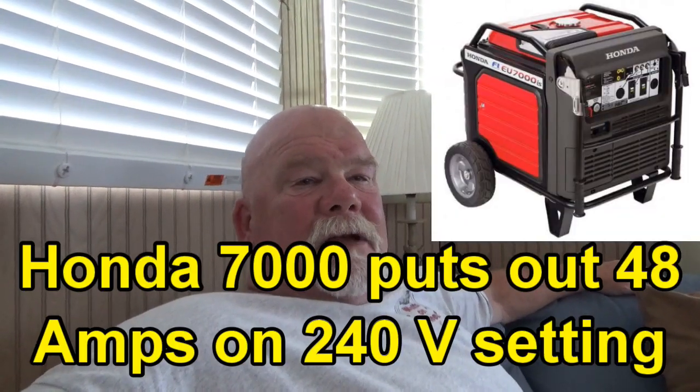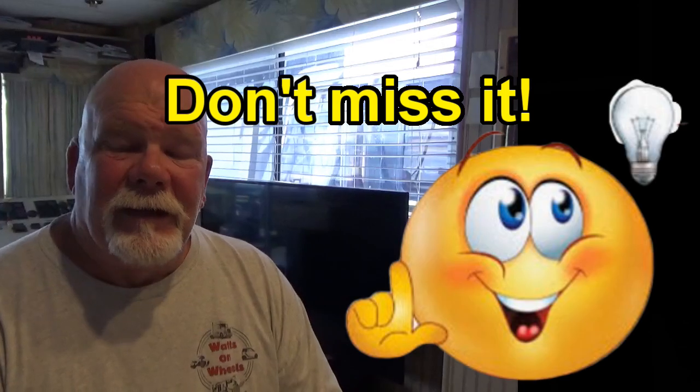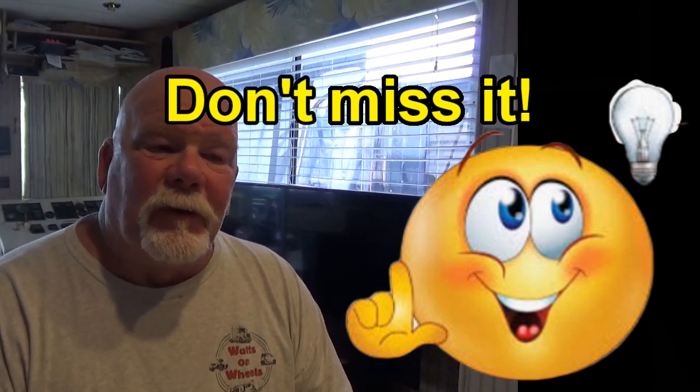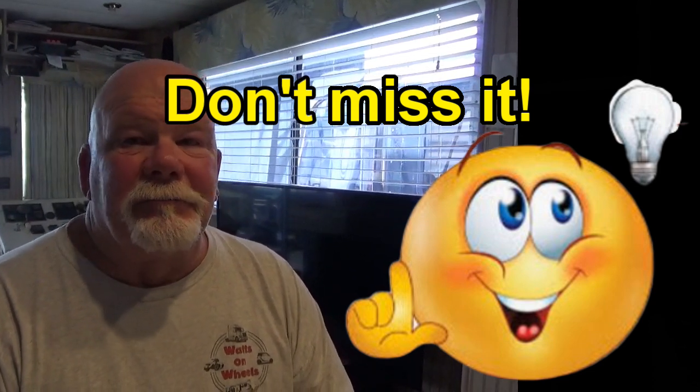In conclusion, the easy start is best when you have a smaller generator and only one AC unit in your RV, so you can still run off the generator with the AC unit and other small appliances running alongside. If you have a larger generator like we do — we have the Honda 7000 — you can run both ACs with easy starts and still have some power left over. Are you glad you put the easy starts in? Yeah, for the generator, because we do a lot of boondocking. In another video, I have a solution where you can be at a 30-amp campsite and have both AC units running at the same time, like you're plugged into a 50-amp pole.